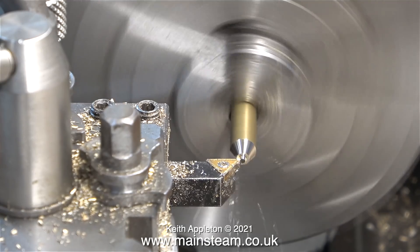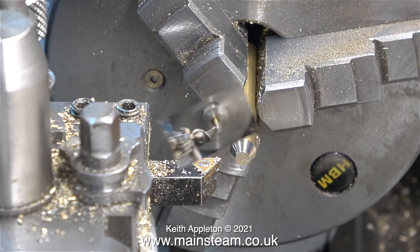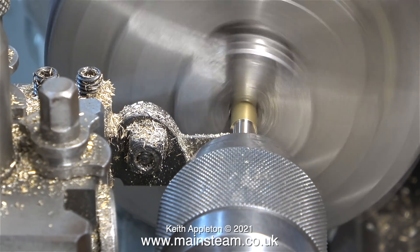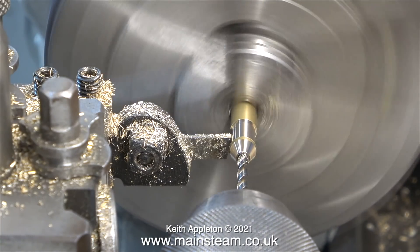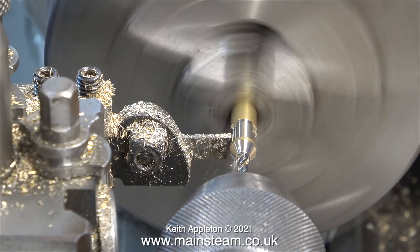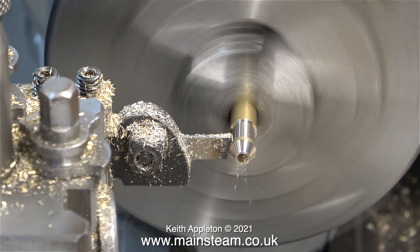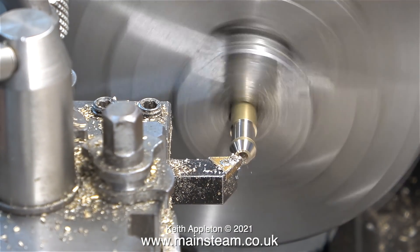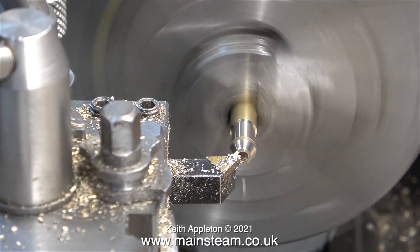I faced across the front just to clean it up and make the tapered part about the same size as the small union cone I used as a pattern. In this clip I'm using a parting tool to reduce the diameter of the piece of brass so that it fits in the union nut. To get this part to the right size I did of course use a micrometer, but unfortunately my hand was in the way and all I got was a nice picture of the back of my hand. After centre drilling the part I drilled it all the way through with a 1/8th of an inch diameter twist drill, then cleaned across the front to make this part exactly the same size as the commercial fitting. If you leave the cone too long it's likely to bottom when you tighten it onto the tap and that wouldn't seal properly.